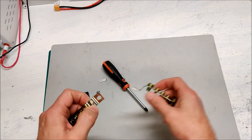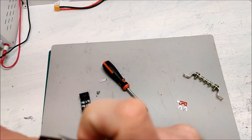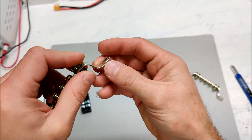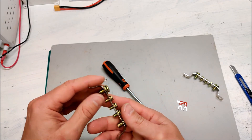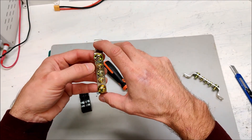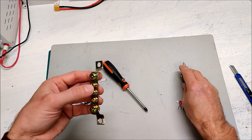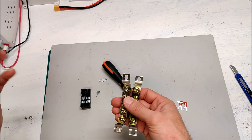I don't think this is pure copper — in fact I guarantee it's not. Scraping it with a blade, it's probably a silvery brass material the whole way through. But the decent thickness and cross-section mean this should carry 20 amps without even breaking a sweat. I'll screw this onto the back of my power wall, attach my two main power wires and my auxiliary connections, and make one positive and one negative. This will definitely solve any overheating issues I had on the bus bar.